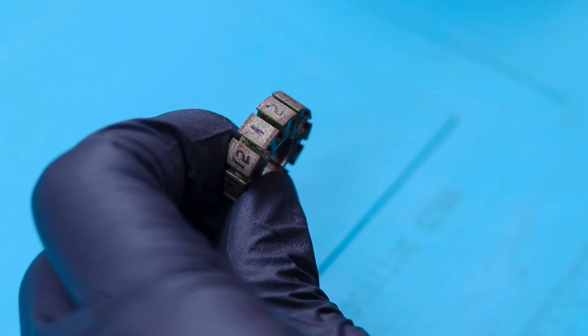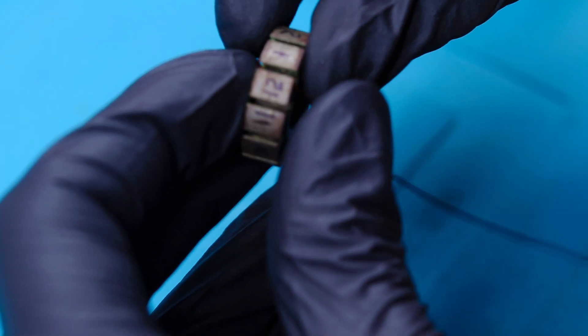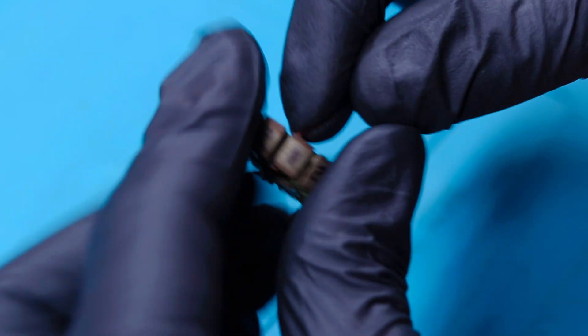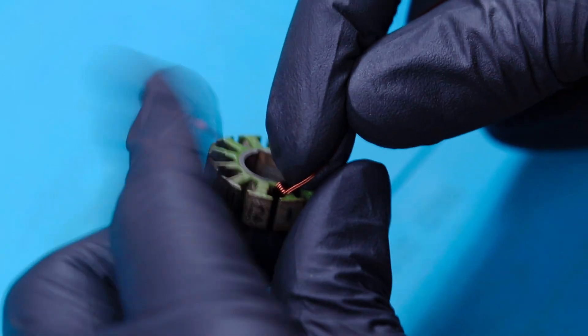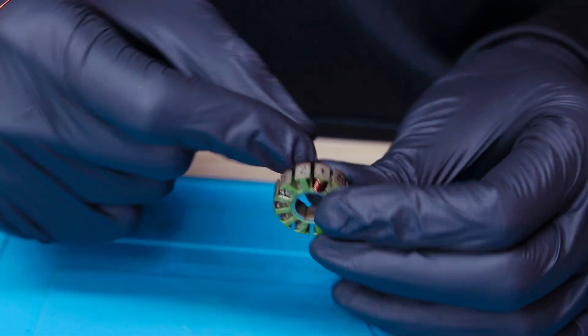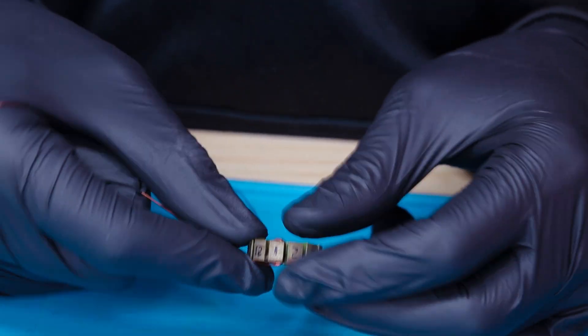According to the winding pattern, we are starting with tooth number one by winding it in the clockwise direction. There is a calculation that helps you change the kV of the motor by changing the number of turns, but in this case we are going to rewind the motor back to the same kV. Instead of the original multi-stranded copper wire, we are using single-stranded copper wire here, as it will be much easier. By the time you complete one turn, make sure you tighten the copper wire while pulling it — this will give you a clean look and the winding will look intact.